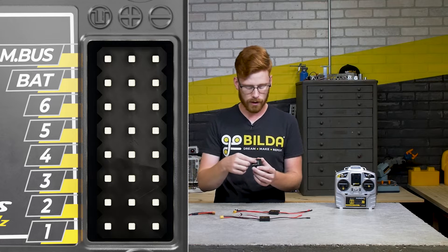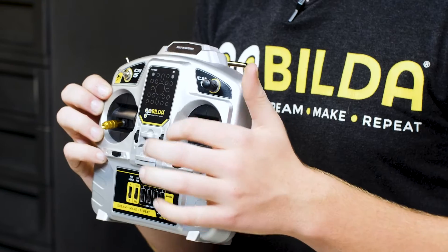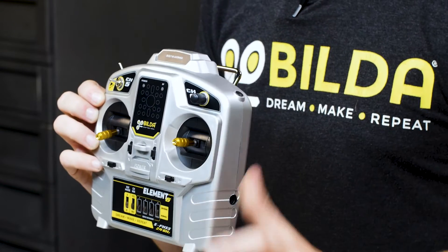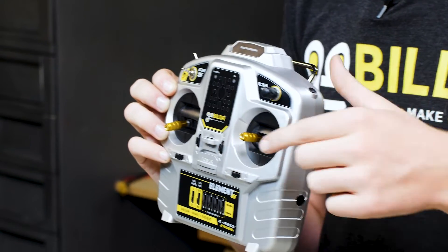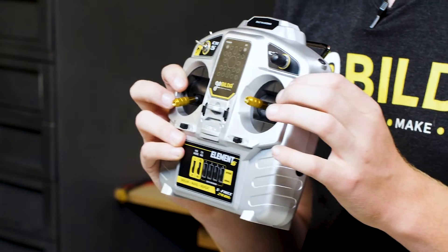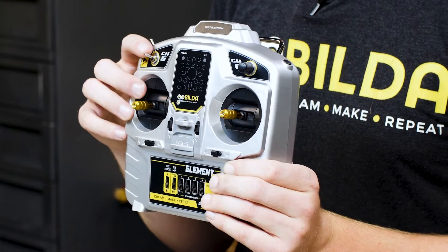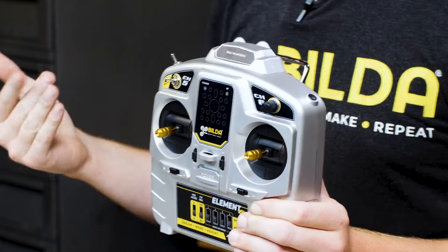When plugging in your motors or servos, you may wonder which ports to use. The first six ports are labeled and correspond with inputs on your transmitter. Channel 1 corresponds to the right gimbal moving left and right, controlling position or speed of a servo or the speed of a motor controller. Channel 2 is up and down on that same gimbal. Channel 3 is up and down on the other gimbal - and is a throttle channel, meaning it is not sprung and will stay exactly where you leave it. Channel 4 is left and right on that other gimbal. Channel 5 is a three-position switch, great for controlling servos. Channel 6 is a dial for more precise control of servos.